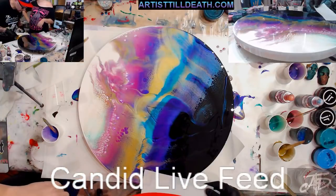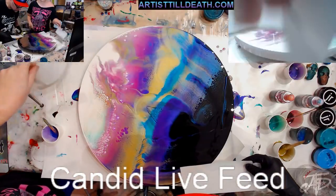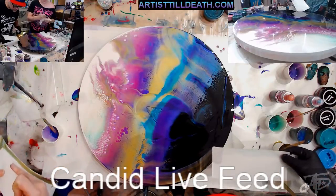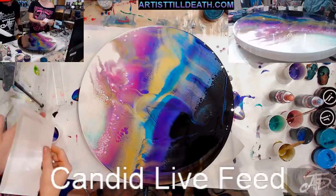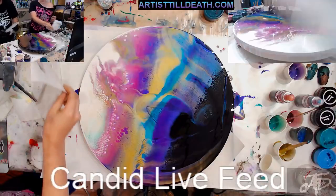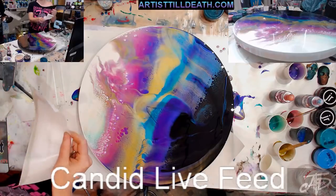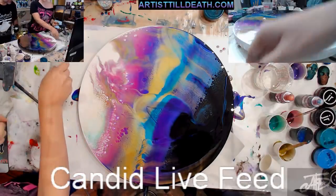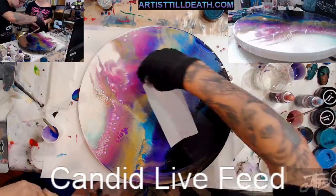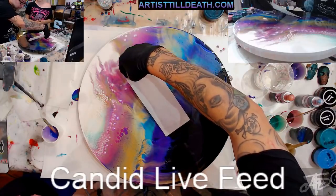We recommend using about a pencil-width of contact — or a pinky. If you lay it down too much you're going to pick up too much paint and get gaps because it'll drag too much paint. You only want minimal contact. And if you go too fast you're going to get skips, so you have to take your time and make sure it's grabbing as it distributes the paint all the way around.